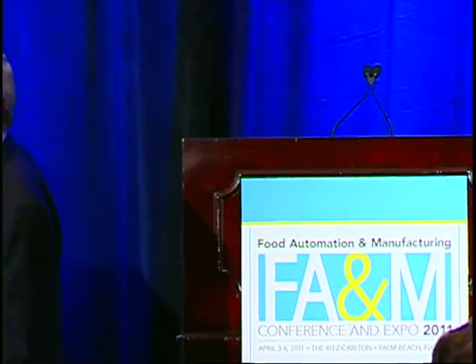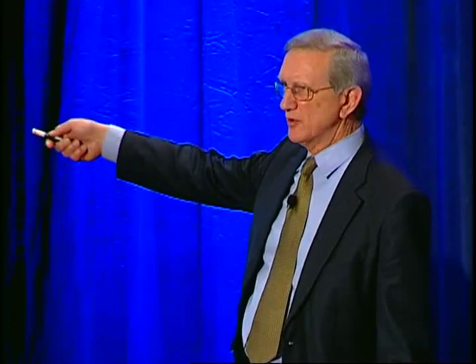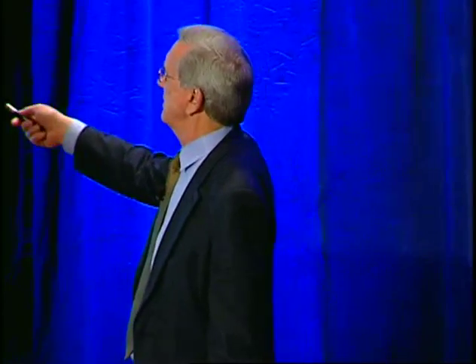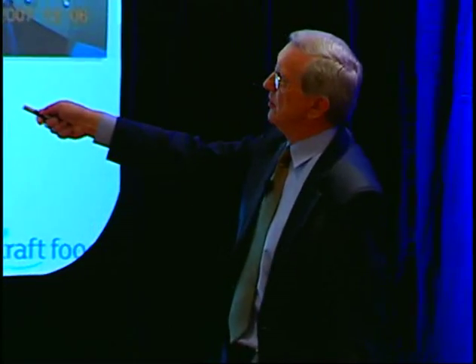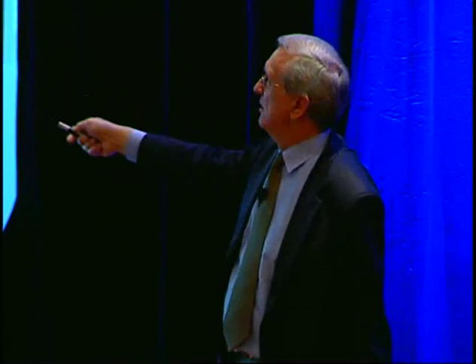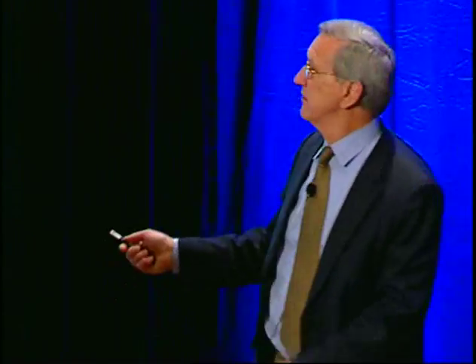Guides — when you convey dough, a good way is to make these side guides tilt up. It provides complete access and you can clean underneath there. Very often you have conveyors with multiple guides that are difficult to reach in and clean. Make it so it's easy to lift simply by pushing down on a bar — the whole assembly lifts, you can do it from both sides or one side at a time. The whole belt is accessible for cleaning and you can easily reach in and wipe everything down.